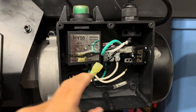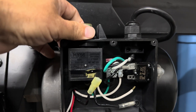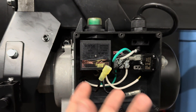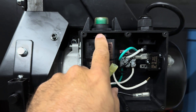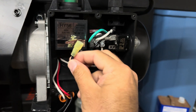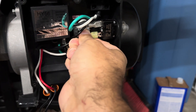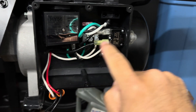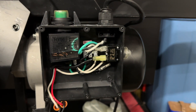That's about it. Disconnect the wire here by unscrewing it — you can also twist it, though it's difficult since it's plastic and relatively soft. Be careful not to snap the stud off. Mine had already been loosened — very difficult to do. Cut the end off, put a new end on. Now we're going from the motor directly into the breaker. We still want to keep that reset function to protect the motor.